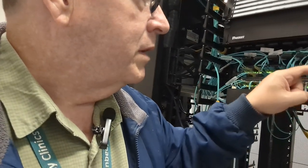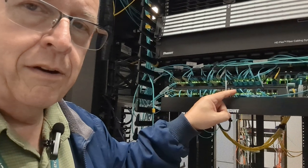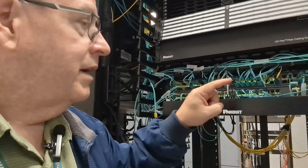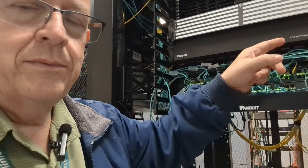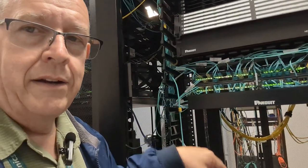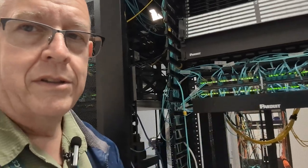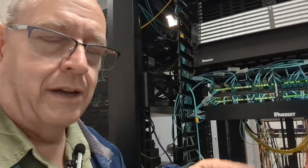Because we have two redundant links from here — from this switch out to that switch. We've got two fiber links, so we'll go from 2-4 and 4-4: card 2 interface 4 and card 4 interface 4. So those two will go out to the top switch in the stack out there. And then this switch's mate down in the MDF will also do the same thing — same card, same ports to make it easy. That goes out to the same thing.